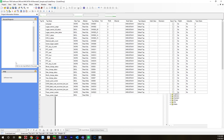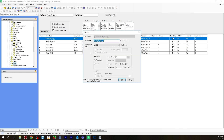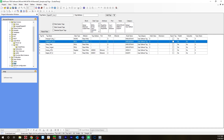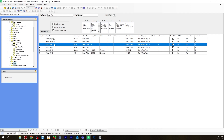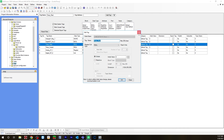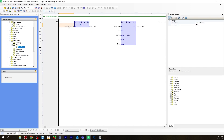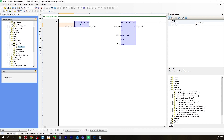To do that, go to your tags folder. I created a word tag here, because it's going to be a data register — analog input register 1, word type, hit OK. For the digital output, because the logic can't read the Modbus address, I created a bool called digital output coil 0 — hit OK. For our scale logic for analog input, I created a real tag called temperature real, and the scaled value will be temperature scale, also a real. Going back to our logic, we'll need to take this word register and convert it to a real. To do that, go to your conversions and take the any-to-real convert-to-real function, drag it over. For your input it'll be analog input register 1 — that word register — and your output would be temperature real, which is your real register.